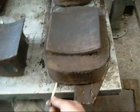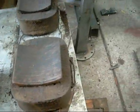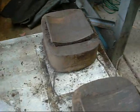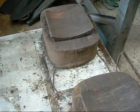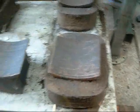All of these windings read 18.5 ohms, plus or minus 0.1 ohms — that's pretty good across the board. The insulation is pretty solid, a nice tar type, very robust. A friend of mine, a motor rewinder, said these things can sit out in the weather for decades, and all that happens is rust builds up and locks the rotor. So as long as you free the rotor up and clean up the brushes and the commutator bars, you can run it just as it is.